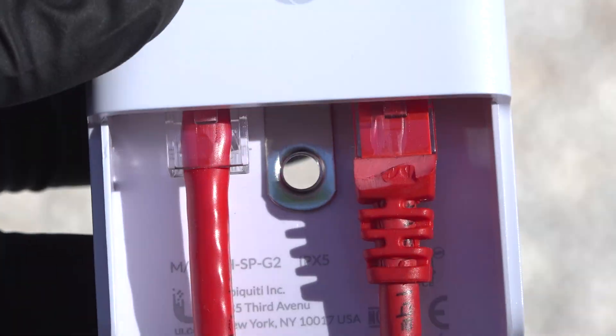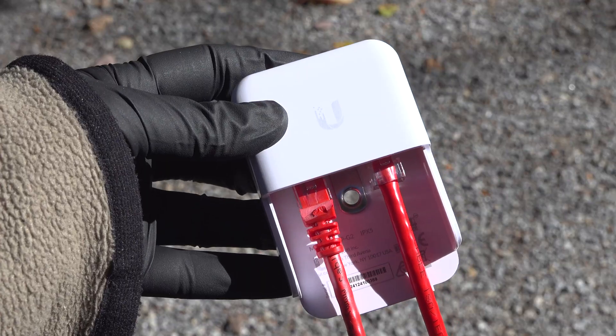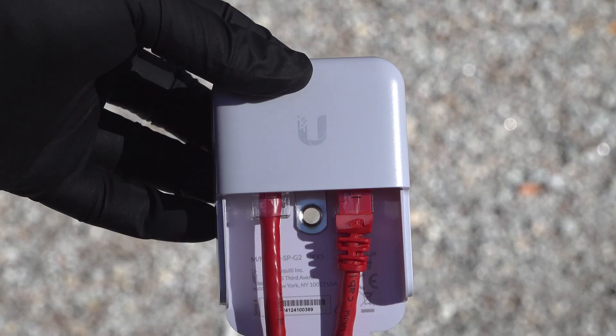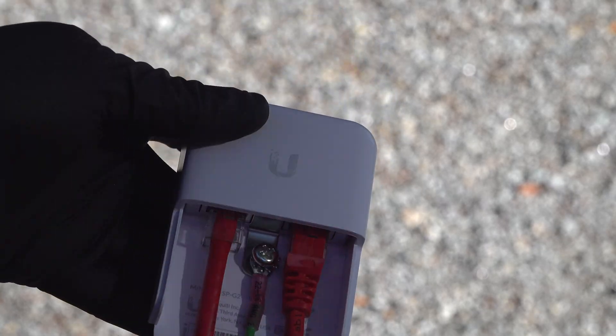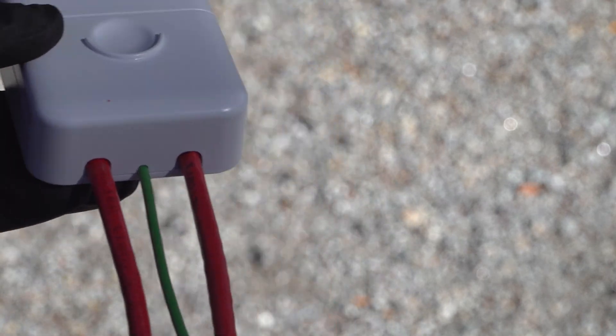Because in addition to those two ethernet wires, there is one more connection that maybe isn't that obvious. This screw hole that is in fact the mounting hole also doubles as a grounding port. This metal tab runs all the way up to the ethernet jacks themselves. There's no such thing as a surge protector that can just eliminate a surge by itself — they've got to have a way to dissipate any electrical power you don't want. That grounding point is your path out. So you've got this unwanted surge that comes in and instead of frying your equipment, you safely move it out the grounding port right back into the ground. You can use one of these protectors in your house and connect the grounding point to something like a water pipe or even use your grounding plug in your electric outlet. But when you're outdoors, you don't have that luxury.